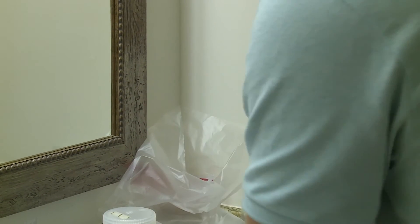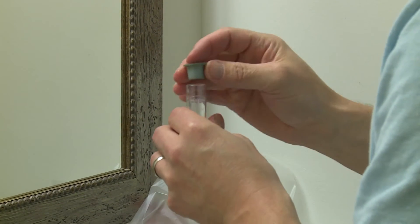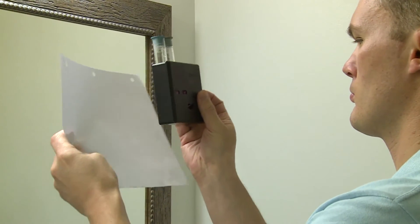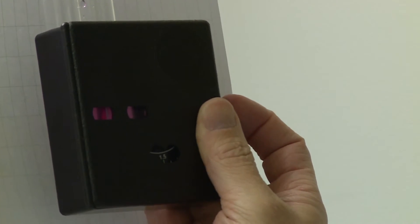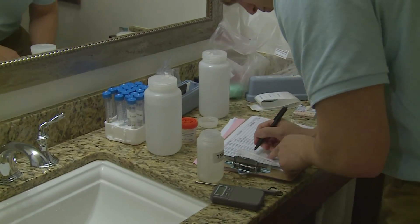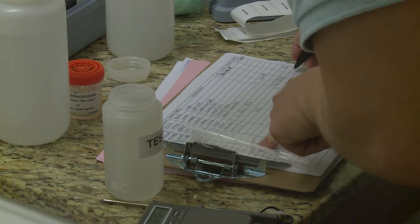Remember, if chlorine is the residual disinfectant, you'll want to measure free chlorine. If monochloramine is the residual disinfectant, you'll want to measure total chlorine. Add water to the marked level. Place both tubes into the box and compare them against a white background. Turn the wheel until the pink color in the measuring tube matches the color in the control tube, and note the number on the wheel. If you are using a different chlorine measurement system, follow the manufacturer's instructions. You should not use pool test kits since they are generally not sensitive enough for the low chlorine concentration in potable water, which is often less than two parts per million. Record all data on the sample data sheet.